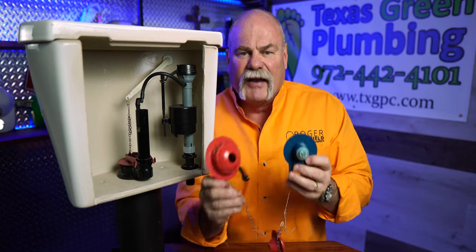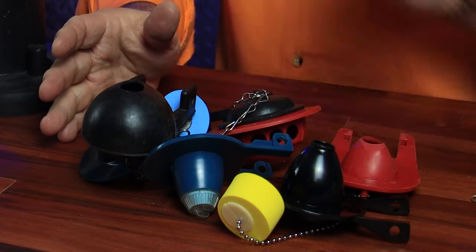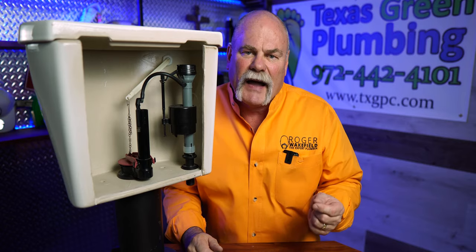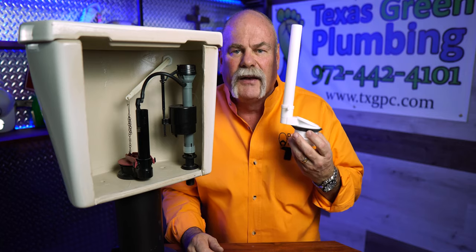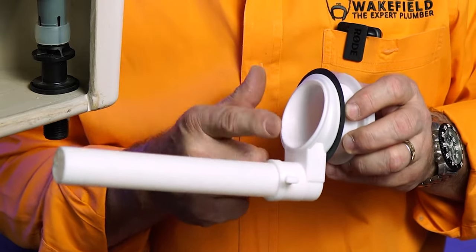The big tip is getting the right flapper. As you can see there are different sizes, colors, and shapes — this can be overwhelming even for a plumber. A lot of these are universal, but some are made by the manufacturer. One of the best things to do is look inside the tank lid for a model number, and look on the front of the tank and bowl to find the manufacturer. If you can determine the manufacturer and model number, contact them to get the right flapper — that is the best thing to do. If you're going to get the flapper, you might also go ahead and order the entire flush valve assembly, because if you feel the seal and it's not smooth, you're going to want to change that out too.